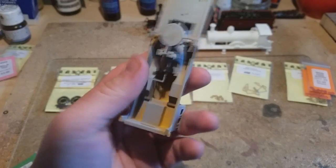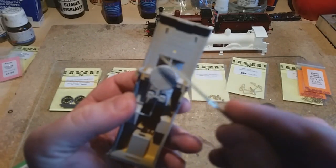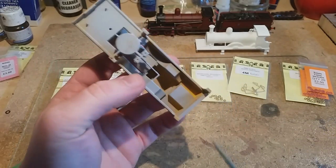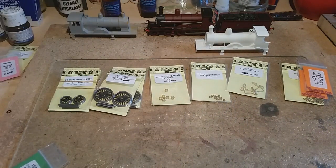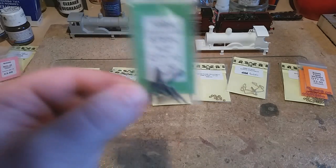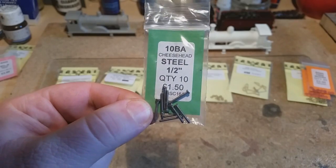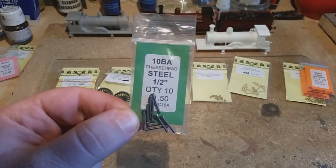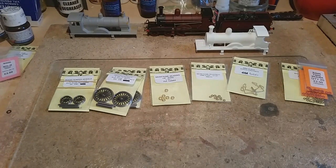With the body on the underside, you'll notice you've got a hole here that goes into the smokebox saddle. You can use different sizes of screws and bolts for those, but these self-tap perfectly. You can take them in and out a million times and it's fine. So 10BA — if you use a slightly bigger size, which would be 9BA or 8BA, you can get away with it, you just have to open the holes out a bit to accommodate. But they're self-tapping and they're very easy to use.